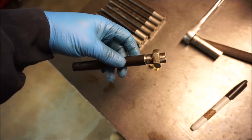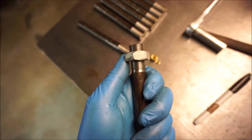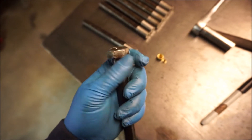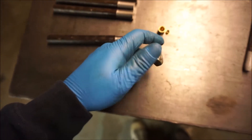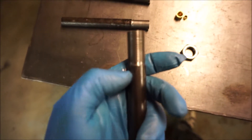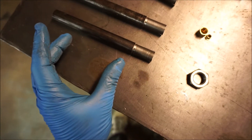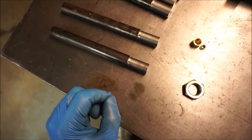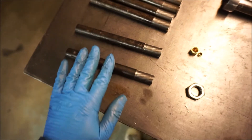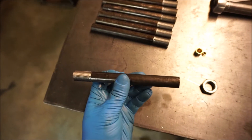These are just going to be the shafts where the hubs slide on — these are 5/8, not 3/4. I put some nice fine pitch threads on there. I'm probably going to get a locking shaft collar since USLMRA rules require either a double nut or a cotter pin, which I'm not going to do. I'll get a threaded shaft collar, 5/8, so I can thread it on and set my preload a little on the bearings to keep the hubs where they should be, then lock it down. These are 4140 chromoly steel.